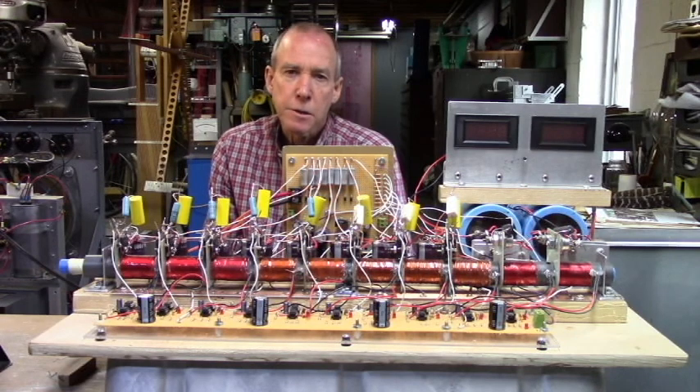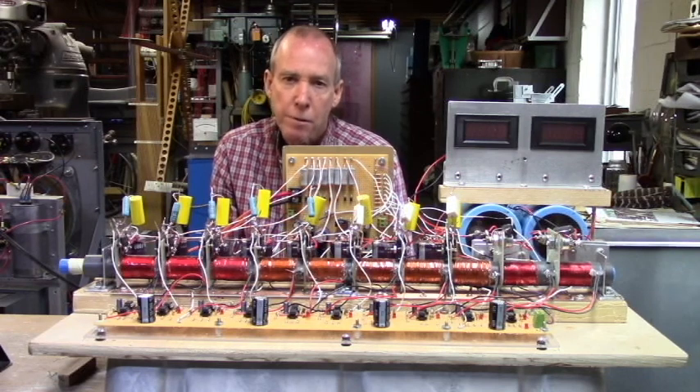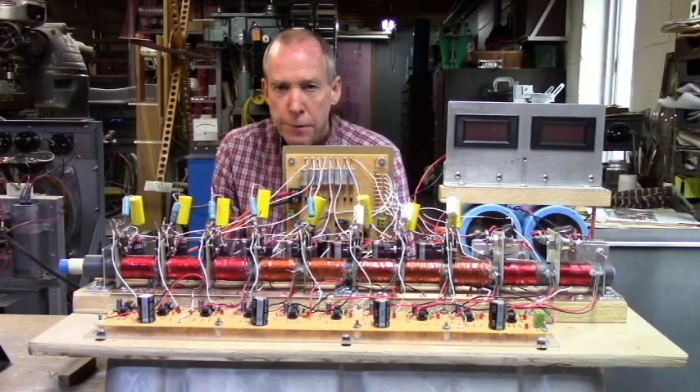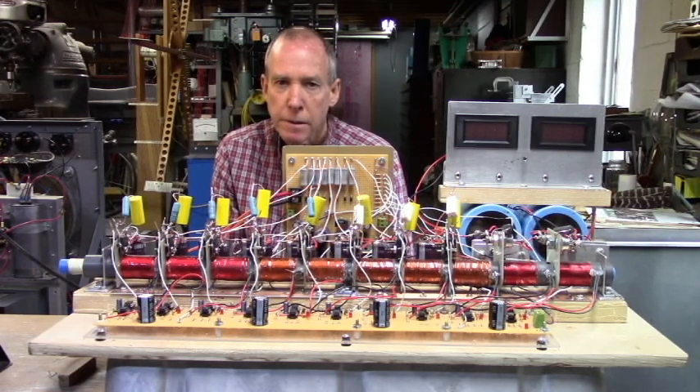The best I could do so far is just under 130 feet per second. That's not very good. The snubber circuit works good, the driver works good, and the trigger works good — something is holding this down. The first two stages of the SCR drive will send that projectile about 106 feet per second, so there's a major drag, and I would suspect it's the timing.